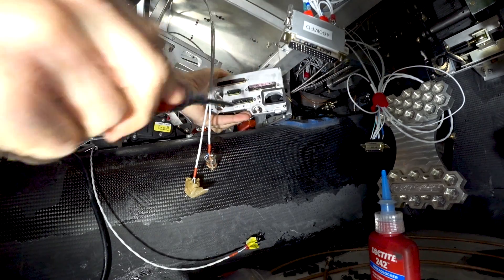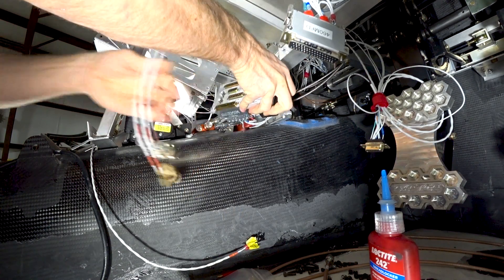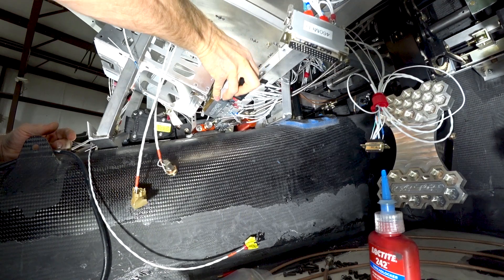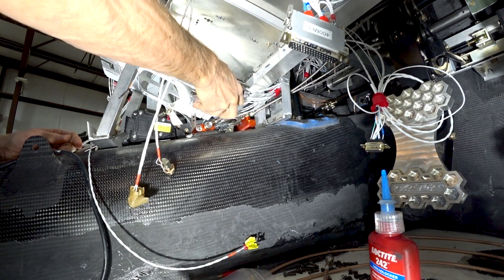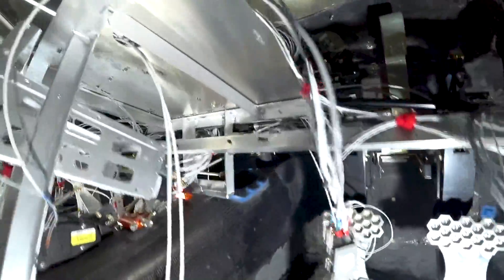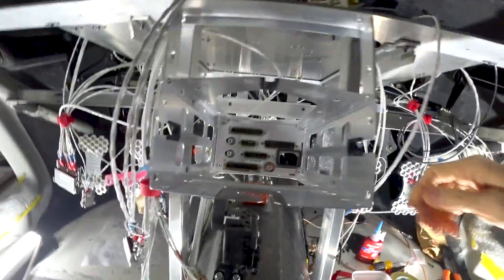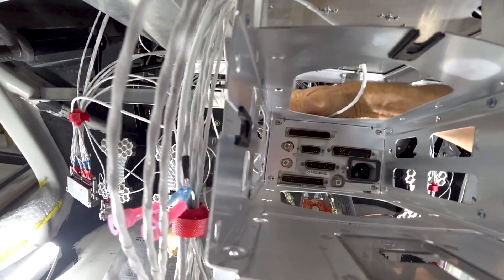It's incredible how much is involved in this wiring. Looking at how Cirrus does their aircraft, their wiring has way more runs because their LRUs — line replaceable units — are stored in the tail of the aircraft, whereas here there's room to put them all up front. That back plate is now sitting in the back of the housing with three or four screws tightened up.